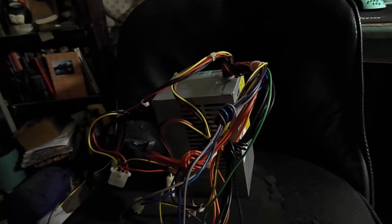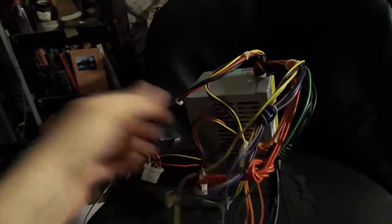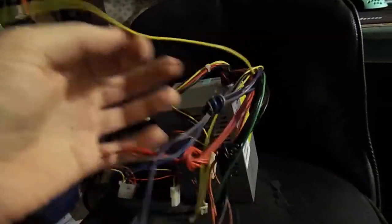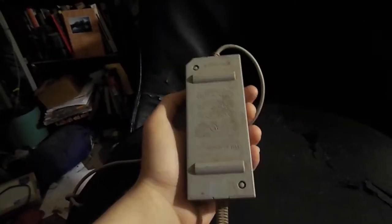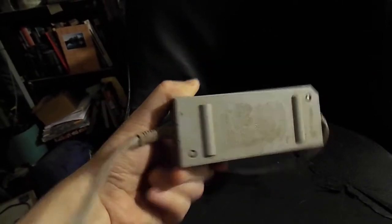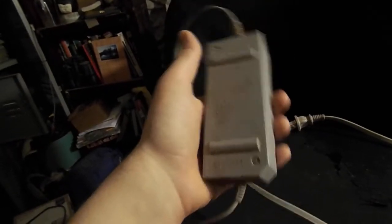I think this is getting a little long, so I don't want to bore you too much more. Basically, it's super easy to experiment. Get yourself some power supplies, be safe — don't go sticking forks in walls. I would recommend looking at a few videos first; they'll explain it a lot better than I do. Make sure the amperage is 3 or above. Cheap power supplies do get warm, so I wouldn't necessarily recommend those. Get yourself 3 amps, 12 volts or above. Research before you randomly start doing stuff, and you should be good.